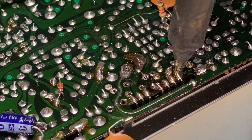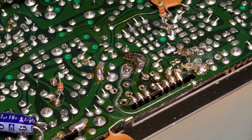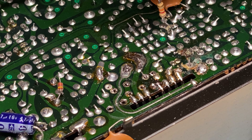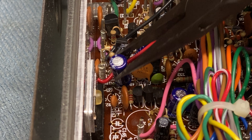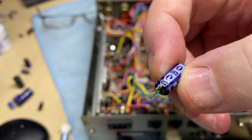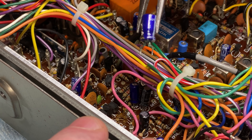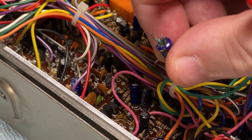That's one of our first troublesome connections where the solder has just turned to dust. Let's pull a few capacitors out — these are the troublesome 100 microfarad capacitors — and that one's absolutely crusty, yeah that's rotten, that's bad. Let's pull the other one and sure enough exactly the same — absolutely rotten. That's been rotting for quite a while.